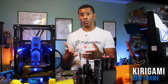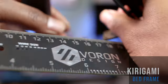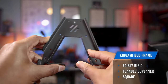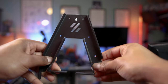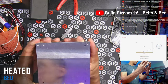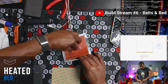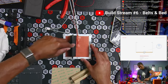For the Kirigami frame, I actually found it to be quite square out of the box. I didn't have to bend or contort it to ensure the carriage flanges were co-planar. I did do a little minor tweaking just to make sure they aligned well, but compared to what I've seen from some other people on the Voron Discord who had to really tweak it significantly, I thought it came pretty square. I also think it's quite rigid — torquing on it myself, I couldn't easily get it out of skew. I did have a number of problems with getting the bed installed in general, which I'll go into in greater detail in the issues section.